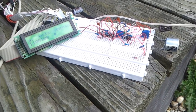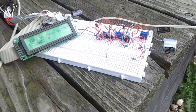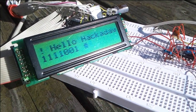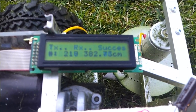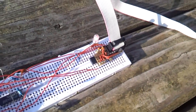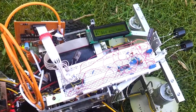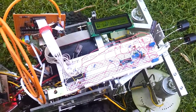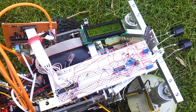For this positioning system, data containing — for example — a destination node's address needs to be transmitted via the ultrasound burst. After reliable data transmission was possible, measuring distances was the next step. There is a prototype of a normal node and the master node, and measuring the distance between them works very well. The range is 1.3 to 6.3 meters, but it is only limited by a fixed signal boost, and a digital potentiometer will fix this limitation very soon.